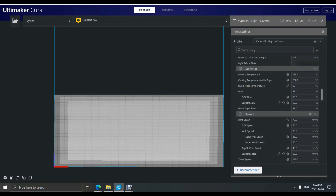Here in the material tab is where you have your printing temperatures and flow percentage. I generally have my initial layers set five to ten degrees higher than what I'm printing, just to help with bed adhesion. For flow percentage, you'll calibrate by printing a single wall cube at 100% flow and taking a measurement. I have my first layer set a couple percent higher, same with the infill and support, to help those print a little bit stronger.